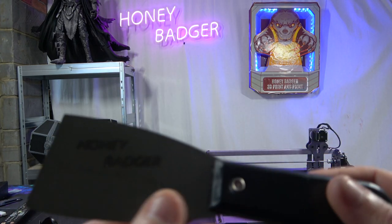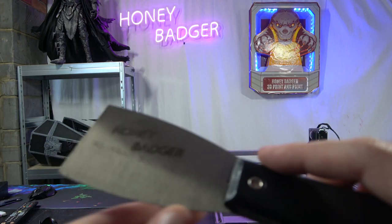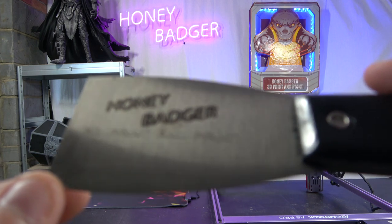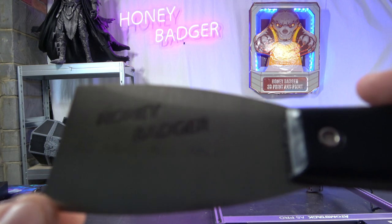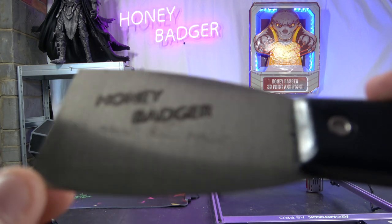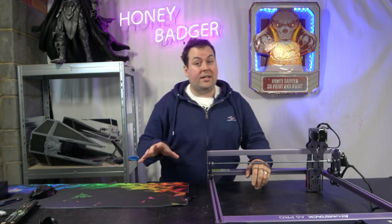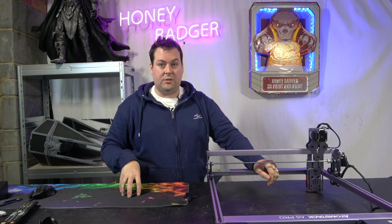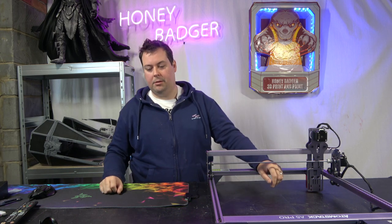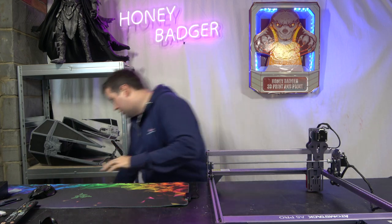You have to be really careful with reflective surfaces because they can damage the laser. You literally color the surface in with a dry erase marker, and this was done at 100% power on a 600 speed with three passes, and it came out really cool. We can now do custom spatulas! We've also done some stuff on relatively small coasters — we bought quite a lot to do lots of testing. This will absolutely do much larger stuff.